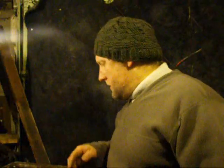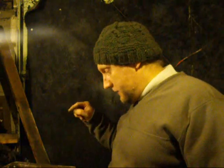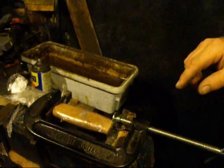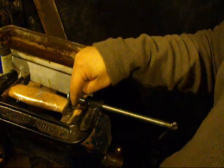Right, seeing as it's Christmas Eve, I'm not going to leave it on a disaster. So what I've done is I've took a piece off the handle. The tang is now squarer, so I've squared the hole in a little butt cap, and I've just cranked it right up in the vice, and a G-clamp, so that the butt cap is stressed against the guard, and there's epoxy in there, and hopefully, because that is bonded onto there, it won't move as much when I try and peen the end over. The other one I did was fine.